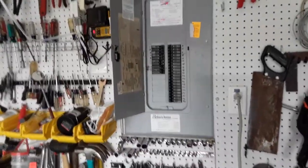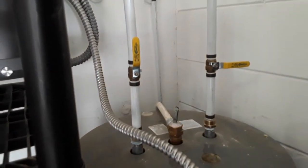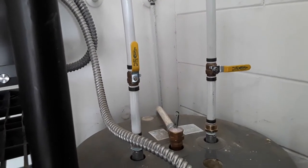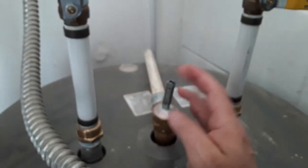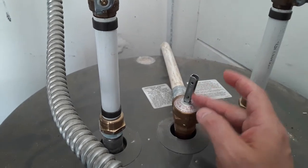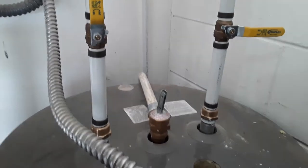First thing you do is disable the water heater on your electrical box — you don't want any electric on here at all. Then turn off the valve to the cold side, put a hose on the bottom, turn that knob, and it lets the water out. To get the water to come out, you have to open one of the hot water sink taps. I lift this pressure relief valve up and it lets air in, so that will let it drain. It'll take about three to four hours to drain.